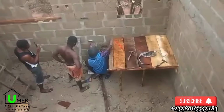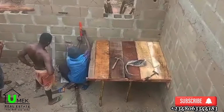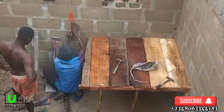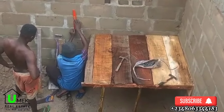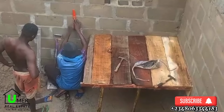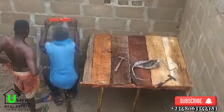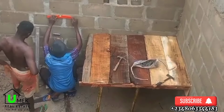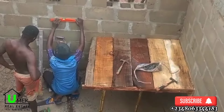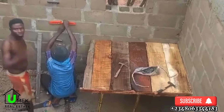After taking care of the flooring of the decking, the next thing that is considered and done at this stage is the linkage between the ground floor and the first floor of the building, and this is, of course, the stairs. Now, the stairs are carefully marked such that you ensure there are equal risers and equal going from the beginning up to the decking level.